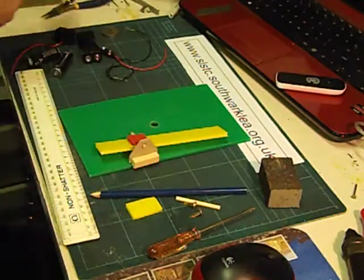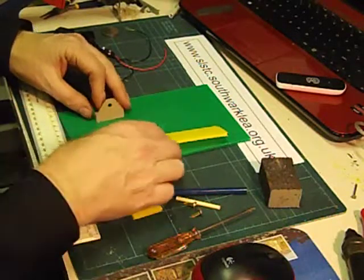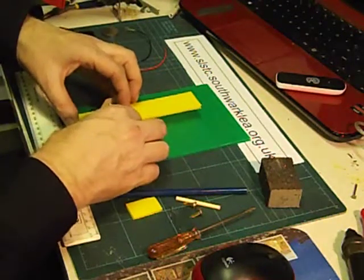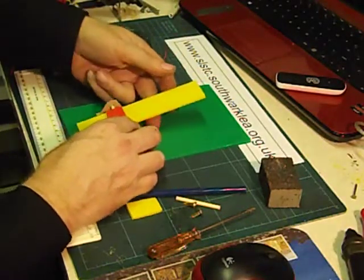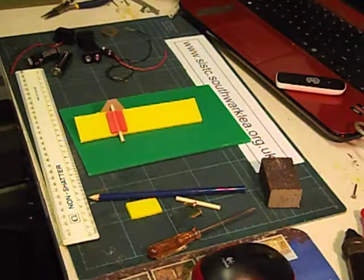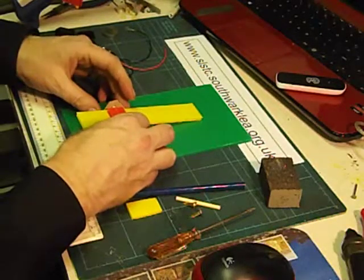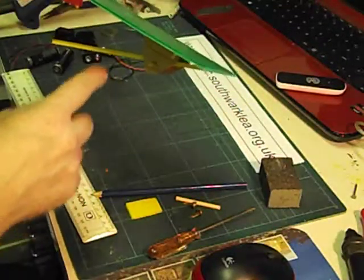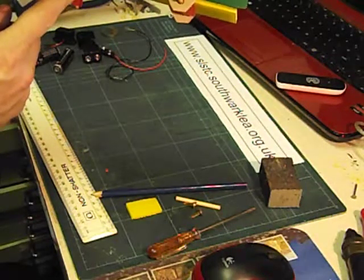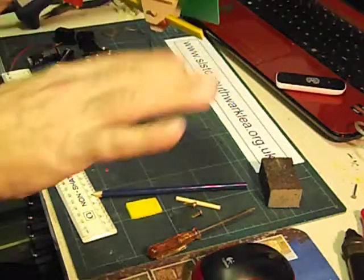Make sure there's plenty of room between the two supports so that the lever arm pivots freely. Make sure that this part of the lever arm is over the top of the hole in the Corex — that's our pivot arm installed. Now we want this pivot arm, when there isn't something on top, to be in the up position so that the circuit is on. When there is something on the alarm we want it to be off — so it's the opposite of what we usually have with switches.